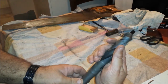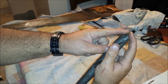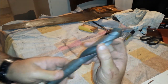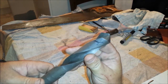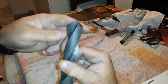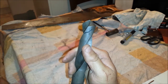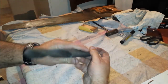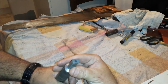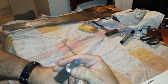Now when you sharpen a drill you've got to make sure that the angles of the cutting edges are both the same. Have a look — there's an X. So what Lenny's done is he's got this edge at the angle that he needs and he's marked it up with an X. He's also drilled a hole in the base of the drill.